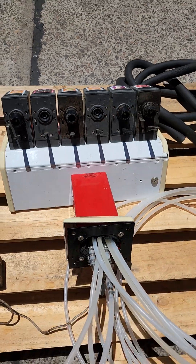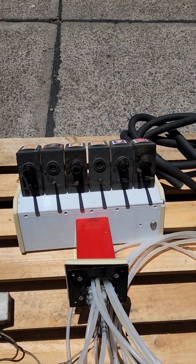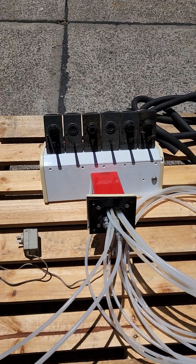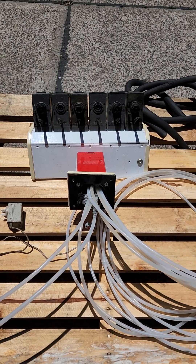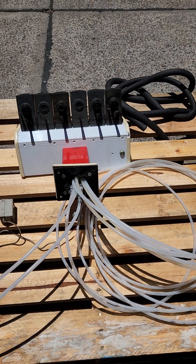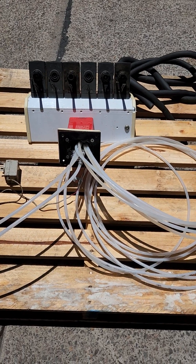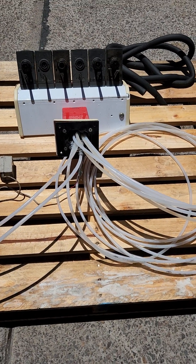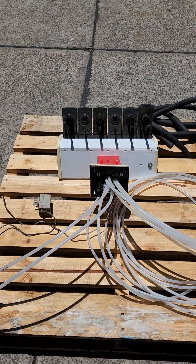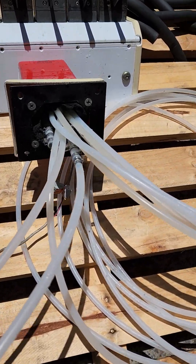When you install this, you want to keep it as close to your machine as possible. The reason is these machines usually have what's called a soda recirculation loop, which means the machine makes the soda water, sends it up to this head for dispensing, then sucks it back to the machine in a loop to keep it cold and carbonated. This one won't have that, so we're going to tap directly into the soda line.